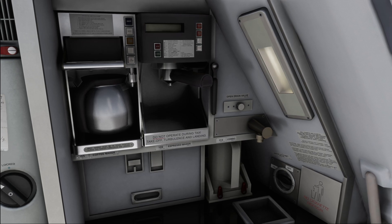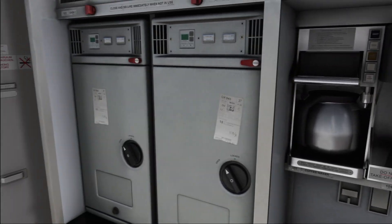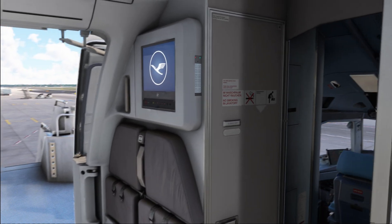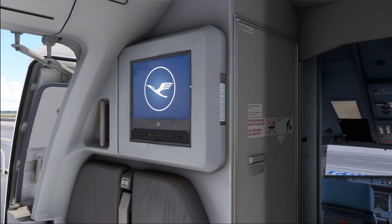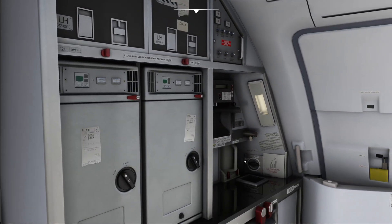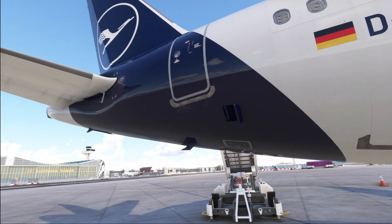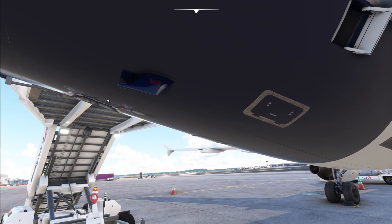To summarize: we have 200 liters of fresh water and a 170-liter waste tank. The fluid levels can be seen on the flight attendant control panel, and in case anything is wrong with the system and the flow won't stop, you have manual shutoff valves located next to each unit. Going to the outside of the aircraft, we have two drain masts for waste water coming from the sinks — one at the back, one at the front — and those are heated so they don't freeze up, though it still happens.